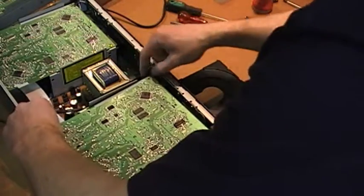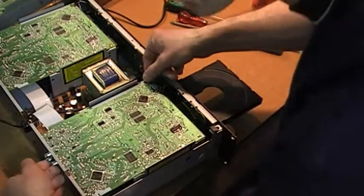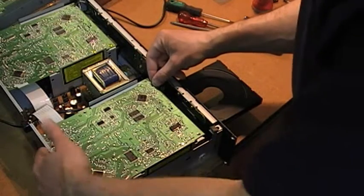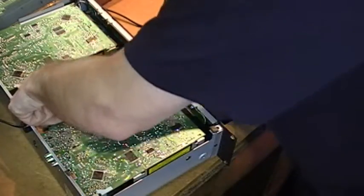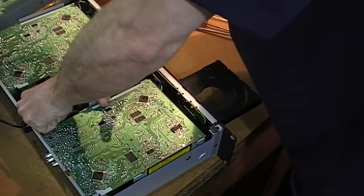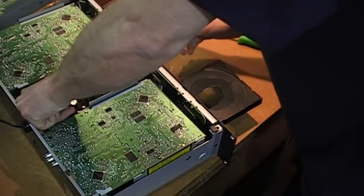Just roughly locate this in the right place. Getting the plugs through the back of the unit, and pass the edge connector under the mains lead and plug that into the power board in the middle.